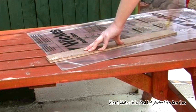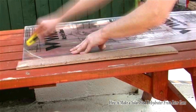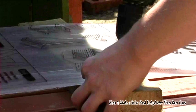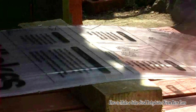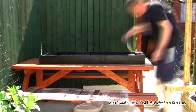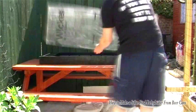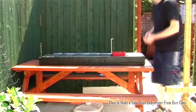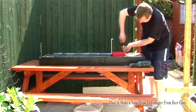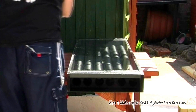Now to cut a sheet of perspex, all you've got to do is score it along several times with a very sharp knife and then you should just be able to bend it and it should snap to the size you want. To drill perspex you must have a block of wood underneath and you must be very gentle with the drill. This stuff is unforgivingly brittle and it's very expensive, so you don't really want to be making mistakes if you can possibly help it. So with the protective cover removed from the perspex I'm now attaching it to the solar collector box and removing the protective film — and voila, we now have a finished solar collector.